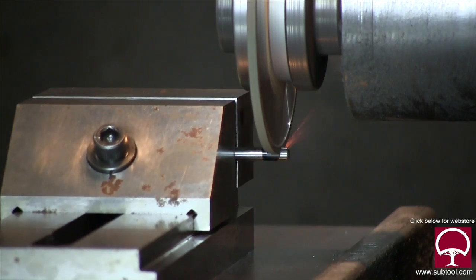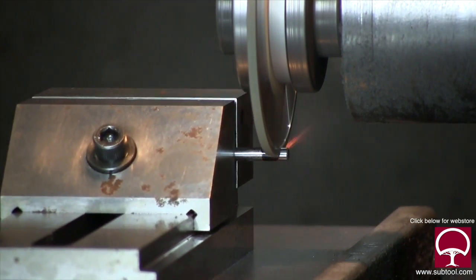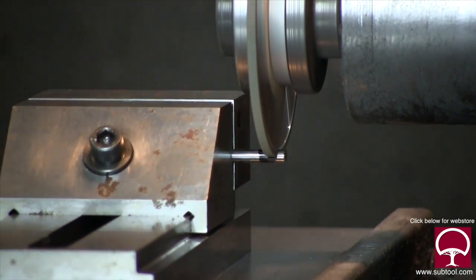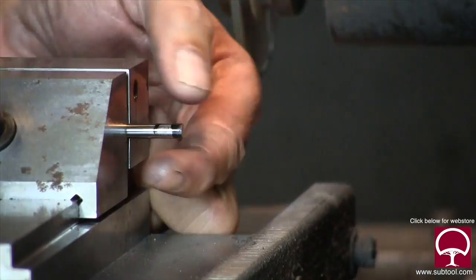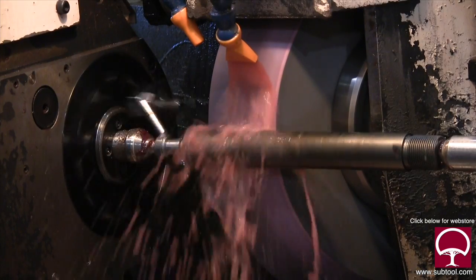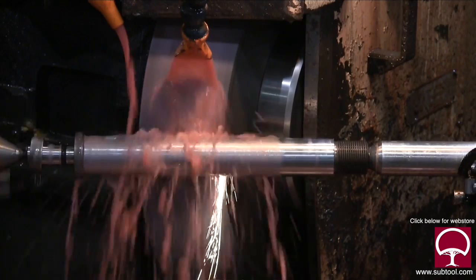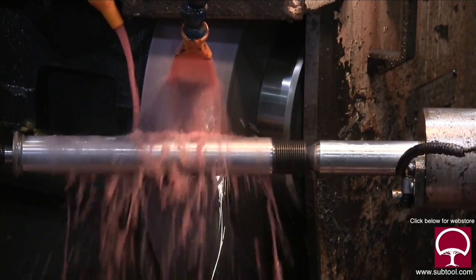Now we're cutting off the carbide tips. In case you're wondering where the carbide came from — we found an old broken end mill and decided to use that as our sacrificial piece of carbide. We cut off five or six of these. Right now we've taken this over to the OD grinder, we've gotten the taper out, and we've got a good looking part coming out. We know what our size is and we're bringing it down gradually to size.